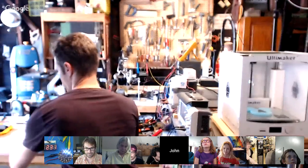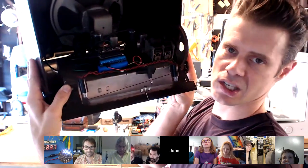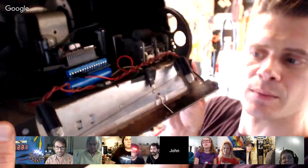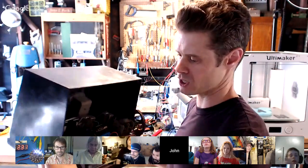And then I also just published a learning guide a couple days ago and a video today for my haunted radio. So the haunted radio project is a vintage radio, a tube radio, which I show you how to update with a Feather. In this case, I've got an ESP8266 in there, along with the Music Maker shield. And what I'm doing is I'm reading a magnet that's on this little dial, if you can see this here. As I move the dial, it will at one point cross a Hall effect sensor, and that'll cause a particular sound file to play.